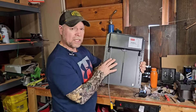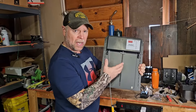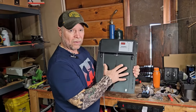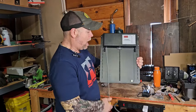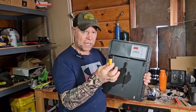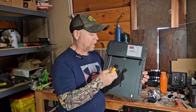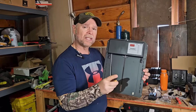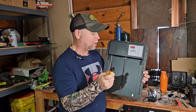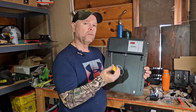It's a good solid frame door. Your chickens and ducks are going to be able to bump into it and you won't have to worry about bending the frame. On the outside of the chicken coop, there's a little sensor. What that sensor does is allow the door to open and close — if something is blocking the sensor, the door will not close. It'll open up fine, but it just will not close.